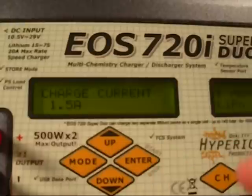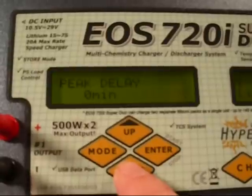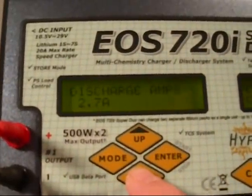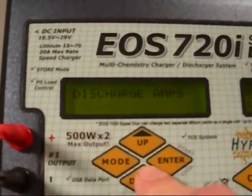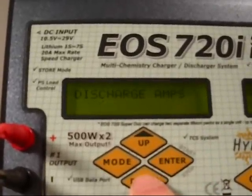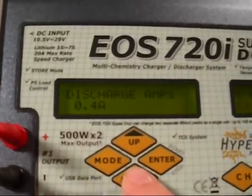So what you have to do for your cycle first, just like I'm doing here, is set up everything: how your battery is going to work, how you want it to charge — just like you're normally going. But then you need to cycle down further to discharge amps. Since it's a receiver pack or any other pack, you can only do up to 500 milliamps on discharge through the balance leads or main leads. So I'm going to put this one at about 400 — that's a standard load for any larger helicopter or airplane.